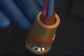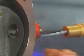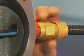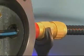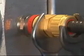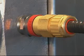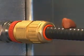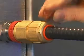Pass the brass pot over the conductors and push down until it engages with the grounding device. Remove any surplus compound from the top of the brass pot and the joint faces. Push the cable into the entry component and locate the brass pot inside the entry. Bring up the middle nut and locate on the entry and hand tighten. Using a spanner or wrench add a further half turn to the middle nut. To further locate and support the compound and brass pot assembly, hold the middle nut with a spanner or wrench and tighten the back nut until the seal grips the cable and prevents movement of the gland. A handy tip is to apply the surplus compound onto the outer sheath of the cable in close proximity to the cable gland. This can be tested periodically to ensure the compound is hard before finalizing the termination into the equipment.